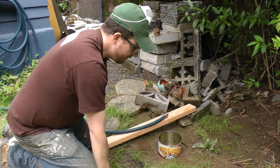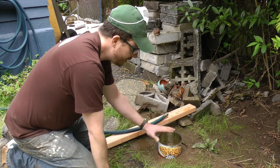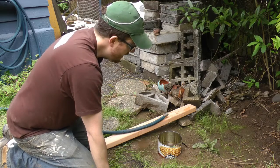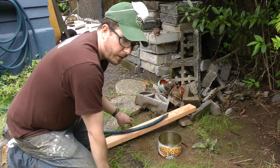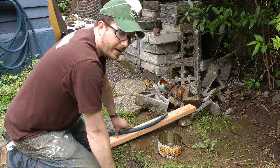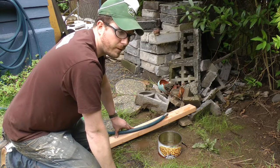The hope is that it will take under an hour to soak in. We'll come back in an hour and then add more water — and at that point you want to start timing it. If it drains within 15 minutes or less, that means you probably have pretty sandy or at least a well-draining soil. You have no problems — depaving should absolutely work for you.